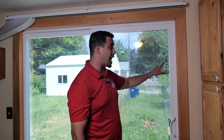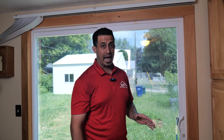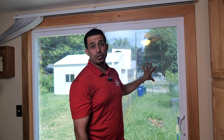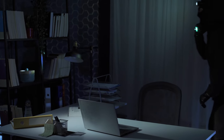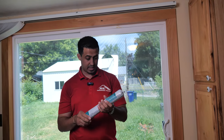If you just install security film without a Dow Corning 995, you're essentially just making the glass go in one piece. So if it does break, somebody can easily just push it in and they've got access. Once you seal it to the frame of the window itself, it makes it so much stronger and able to do what you're looking for — securing your building or your home from an intruder and giving you that valuable time. So let's get into it.